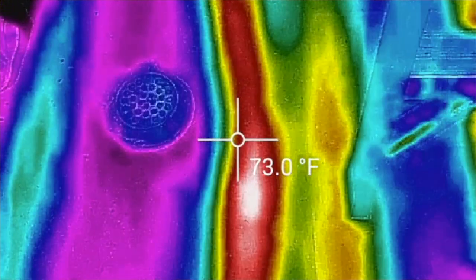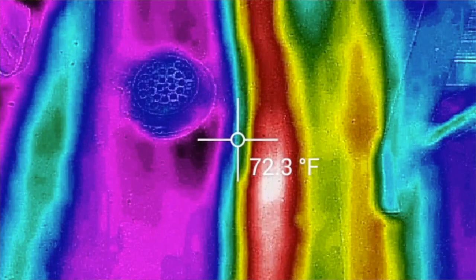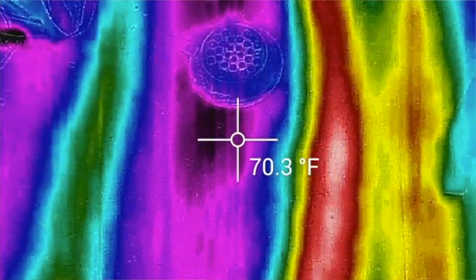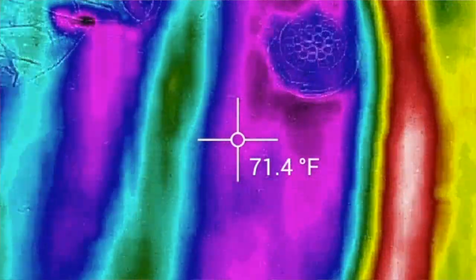I'm lucky — I've got one of these wonderful FLIR thermal imaging cameras that attaches to a smartphone. I turned the heat on and let it run for about an hour so the hot water would heat up the concrete, and it showed us exactly where the radiant heating pipes are. I've got two pipes, one on either side of this floor drain.